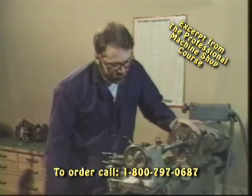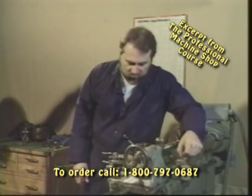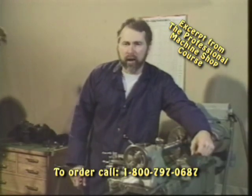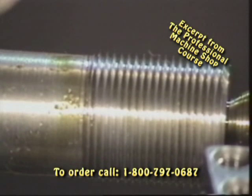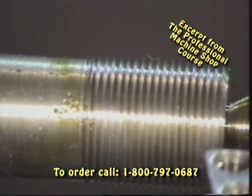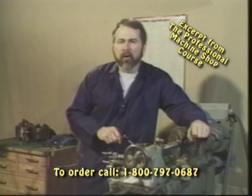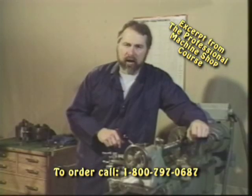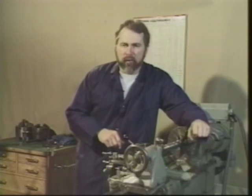We'll give you a close-up view of the thread — it's nice and clean on both sides. We've done a marvelous job of picking up the existing thread and cutting it to final depth. This is something that you can practice: grab a bar of steel or a piece of aluminum, and practice picking up a thread, be it a fine thread or a coarse thread, until you get the hang of it. It's a very important part of your career as a master machinist.